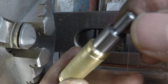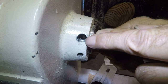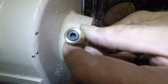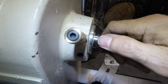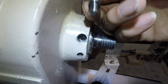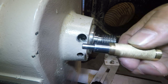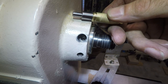Here we have the tool finished, hopefully. I'm going to test fit it on the lathe. Here we are on the wood lathe — as you can see, there are all these little holes in here that index. If I drop this in, it'll plop right in there and lock that shaft completely so I can spin on a chuck or a faceplate, whatever I need to do to put parts on here, and then I can pull it right out again. I'm pretty pleased with this — I think it's going to work out just fine. Now I have to take it over to John's lathe and make sure it fits his, since there are slight differences in proportions and dimensions on the two machines.